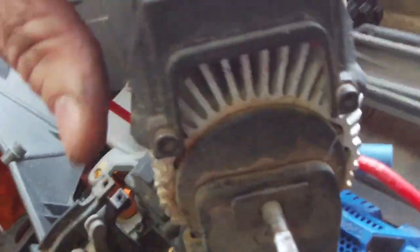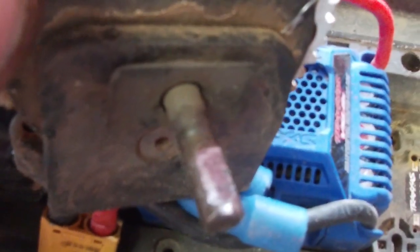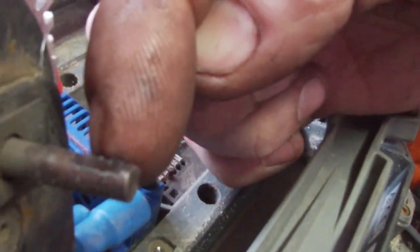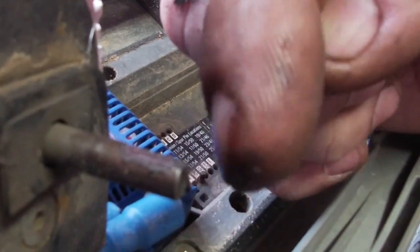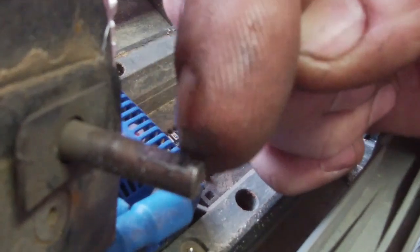Now this is why I like to use a thin little diamond blade or a thin little cut off wheel or whatever like that. It's because I can't hardly see. What it does is it allows me to make a deeper flat from here to about there. I can stop. So if my set screw was loose, it'll have less chance to slide off that end because the flat now is deeper in this little section.